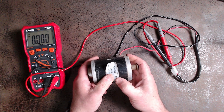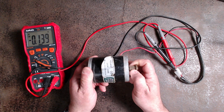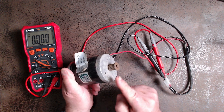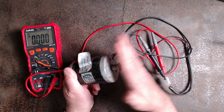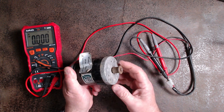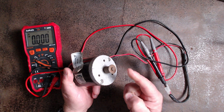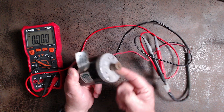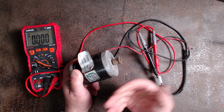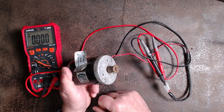Ideally, you're going to charge two batteries on a 24 volt generator — that's slim — but you'd be able to charge a 12 volt battery without too much trouble. The key thing is you need revolutions, so you need to get this spinning fast enough. Instead of just putting a set of blades directly on the motor for a wind turbine, you might be better off gearing it with a toothed belt. Since it's already got a toothed belt, a 600 millimetre diameter set of blades would be enough on something like this.